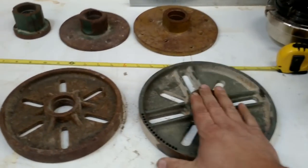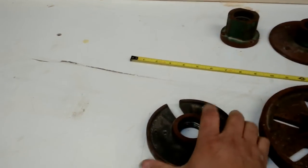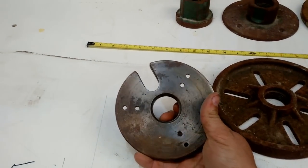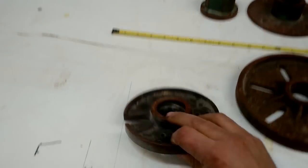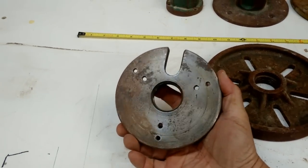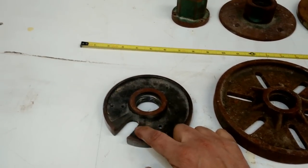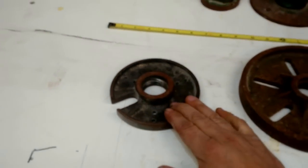Typically I use these on big, heavy chunks. When I put lag bolts in here, I don't have to worry about it. Now these two are your typical face plates. This is a different flavor — this is what is referred to as a driving face plate. It's designed to be used with a drive dog. You would put typically oddball-shaped objects on here, and it would have a collar with a finger on it, driven by this slot. I don't use it that way. The fact that this little piece is missing is kind of irrelevant — I still have six sizable bolt holes to use. At the speed you're turning for the size of stuff I do, it does not throw it off enough to affect balance. These sides are actually thickened, which compensates for what's missing, so surprisingly they're actually quite well balanced.